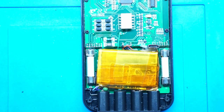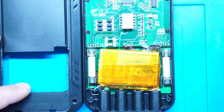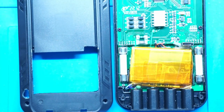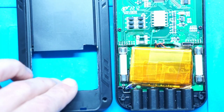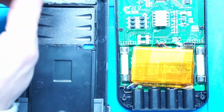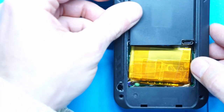Now the LiPo pack may be glued to the PCB with double-sided tape. Right up here is the charging jack. For this we need to make two small cutouts in the rear housing cover and the battery cover. Load your Dremel with the rotary cutter bit and open up the cutout in the rear housing cover. When this fits, put the battery cover back on the rear housing cover and mark the cutout from the inside. Perform the cut in the battery cover, then put the rear housing cover back into the protective cover, mark and cut out.